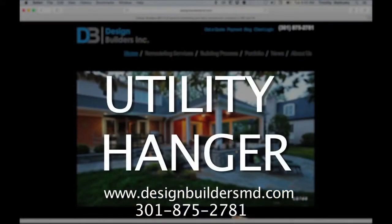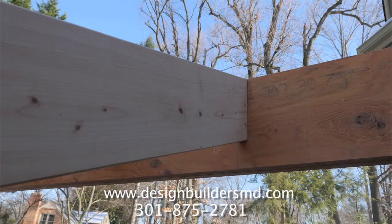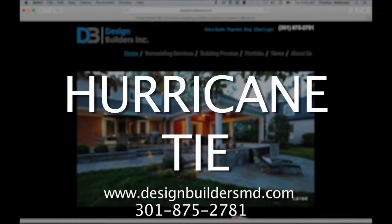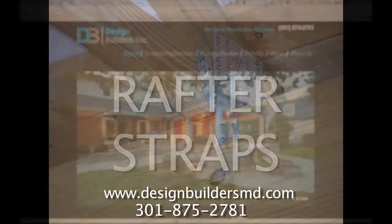Utility hanger. A 90-degree piece of steel, typically about 6 inches long, that's used to connect two pieces of wood that are perpendicular to each other. For roof framing purposes, the utility hanger connects the rafter to the ridge beam. Hurricane tie. A piece of hardware that's used to fasten the rafters to the walls.